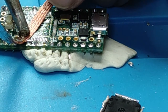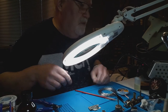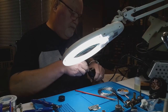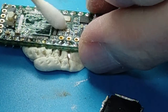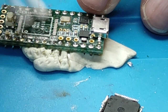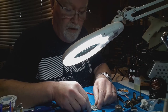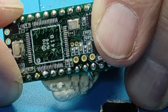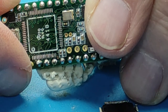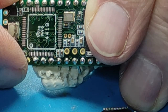This is why you need a magnifying lens. Just to finish off, a little bit of IPA just to clean the pads. It has done a remarkably good job — there is no damage to any of the little pads. If you did not have access to any of the other soldering stations and only occasionally needed to remove multi-pin ICs, then definitely Chipquik is a very useful tool.